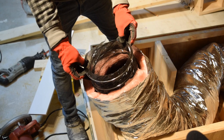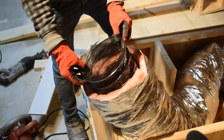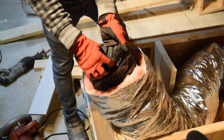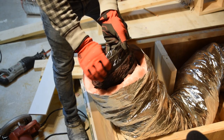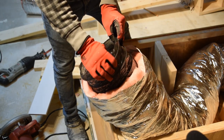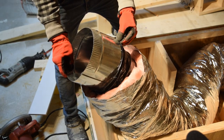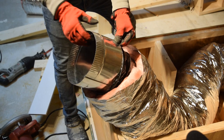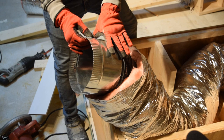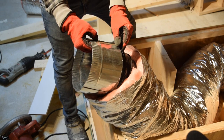This is the duct coming out of the top of the box that will connect to the heat exchanger. If I tried to air-seal this flexible duct directly to the plywood it's just too flimsy — it would never seal well. Since we need to keep sound inside the box, we need a proper seal around the duct. The solution is to transition it to a short section of metal duct for a few inches. The metal collar pokes outside the box, and where the plywood meets the metal I can caulk it and create a really good seal.